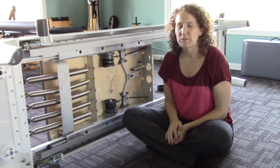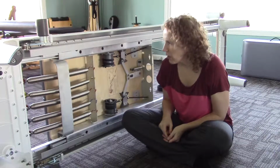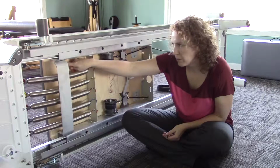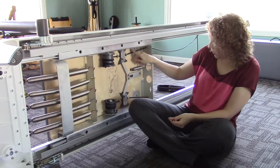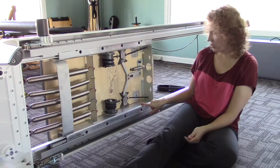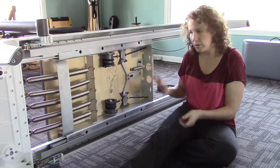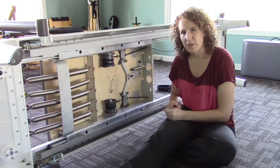Now that the reformer is flipped on its side, let's take an Allen wrench and we're going to loosen all 8 of the screws that hold the carriage pad on. So there's 1, 2, 3, 4, and 1, 2, 3, 4. Okay, once we do that, we can just simply lift off the carriage pad from the other side.